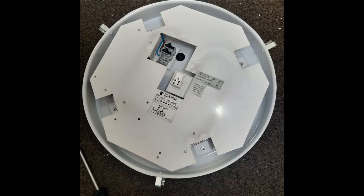Here's one that's actually on the floor. I actually removed it and you can just about see the outline of the 2D lamp there, the sort of connector block in the centre there where that would plug in. Now these are made of sheet steel, white painted, with that sort of round shape with the almost octagonal tray in the middle. These are also emergency lights, so they have a battery pack in the back there, and those are nickel cadmium batteries.